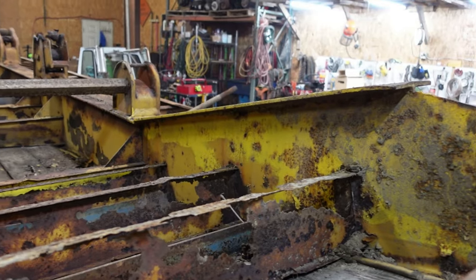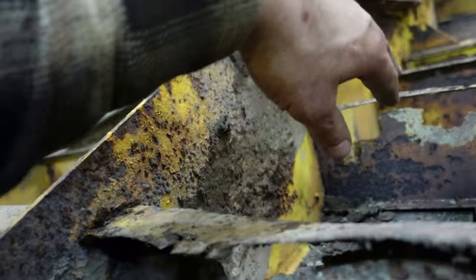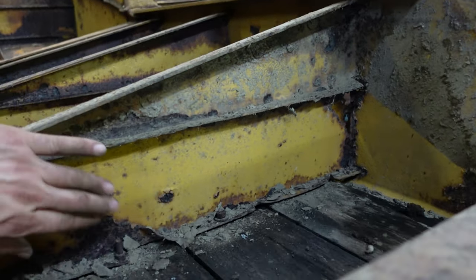But this side of the frame's really not too bad. This side, not as good. I'm gonna cut some full plates that fit this whole tail here, go right to the seam and I'll weld those on. And that should fix whatever issues there are. These are not very good. I think what I'm gonna do,